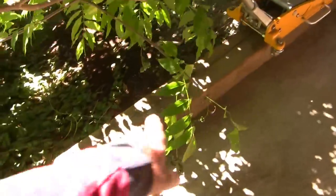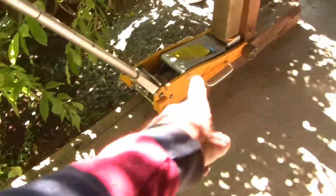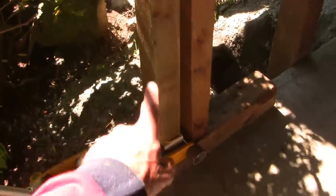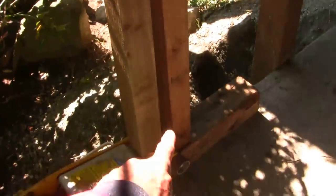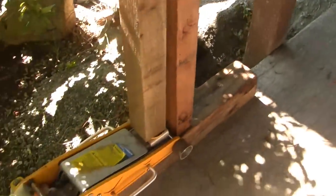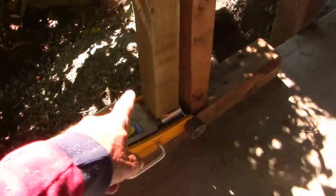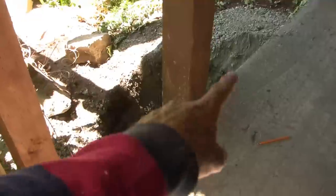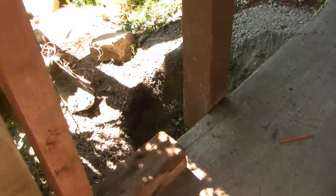We've got a big six-by-six beam here supporting all of the weight and distributing it on the concrete, and then we've used a mechanic's floor jack to jack up the floor a little bit. The main brace is right here, and I'm a bit of ways away from the main post I'm going to remove — I've done that for two reasons. First, I want most of the weight to be on a well-supported area underneath the concrete so it doesn't break. And second, I don't want anything in the way for practical reasons when I'm pouring the concrete.